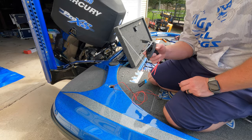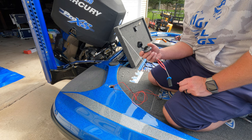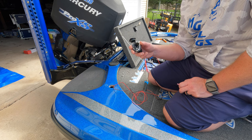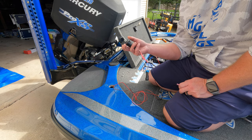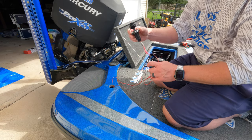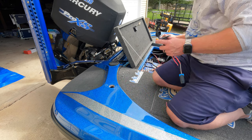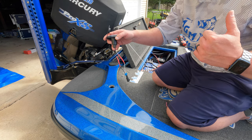I'm not going to do it that way because by tapping in, anytime you power up your socket that blade light will be on. I use my YoloTech power stick a lot for recording on the water, and it plugs into that socket. So if I hook it up that way, anytime I'm recording with my GoPro and the YoloTech power stick, the blade light would be on. I do a lot of recording during daylight and I don't want that light on all the time. So I'm going to put this light back in the boat and keep the deutsch connector separate.